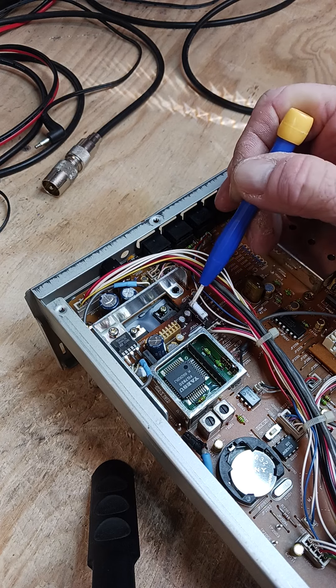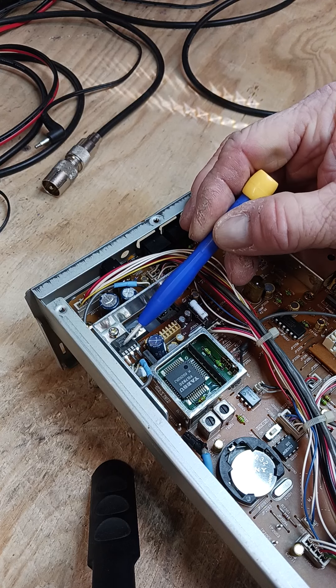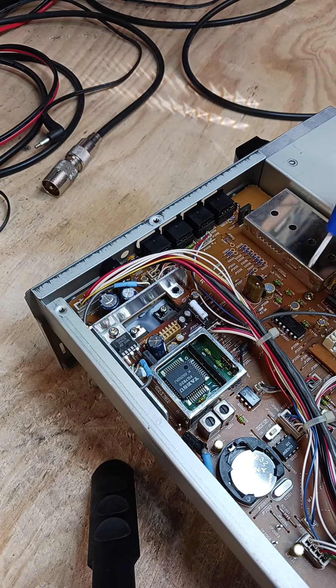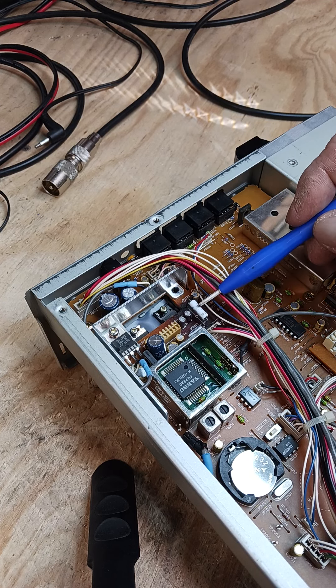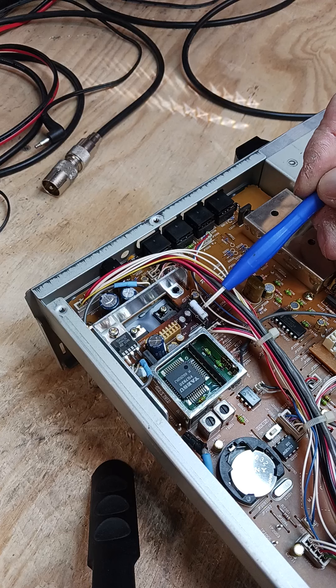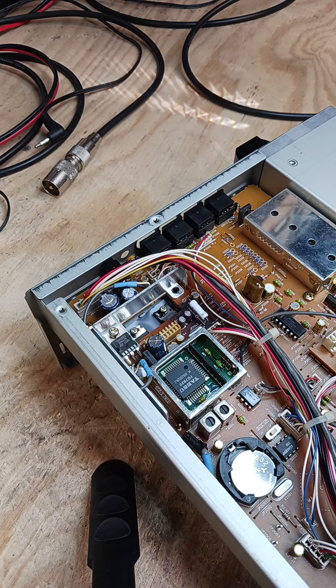The overheating ruins the soldering on the pads to the point where it can actually burn the trace right out, taking out these caps, and the regulators will fail. This is your audio chip. The radio does transmit, does receive, and has strong modulation — however it will need an alignment — but this must be fixed first. The radio was working great until the screen started flashing.